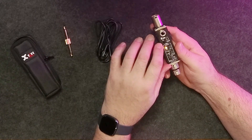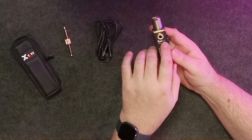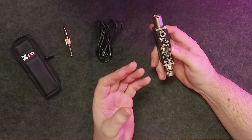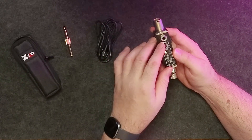We also have a headphone/in-ear monitor connector on the front. There are a couple of indicators for phantom power — this does phantom power tests not only for whether there is power, but also what voltage range you're in. It indicates above or below 44 volts, but anything under 24 volts is not going to read, so it's not for testing 12-volt phantom power.